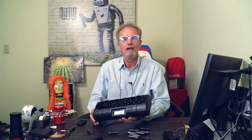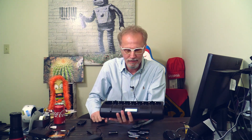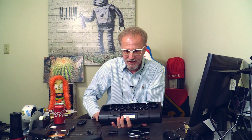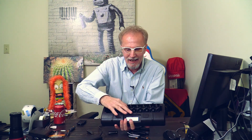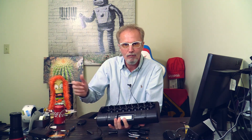The reason those cheap chargers are so cheap — you see here, every battery is sitting in its own little nest. All these batteries in the Maha charger have a direct charge connection to the chip inside, so every battery gets charged and conditioned separately, just by itself. So when this battery here is fully charged and conditioned, all the other batteries are still going on charging and conditioning. Three are full and the other two batteries are still charging and getting full with electricity.